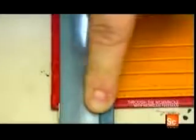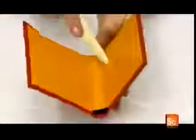The next worker tucks a metal wedge under the rim to protect the rest of the wallet as she trims the rim close to the stitch. Removing these few slivers will make the wallet more flexible. She slides the bone folder into each credit card slot to remove excess glue.